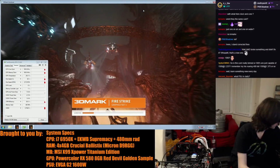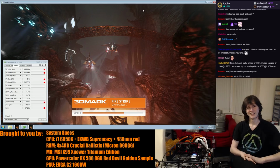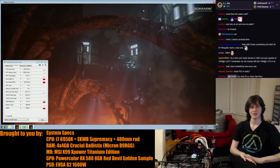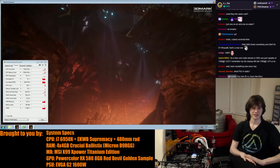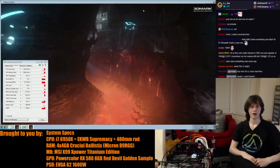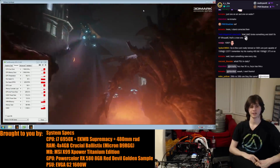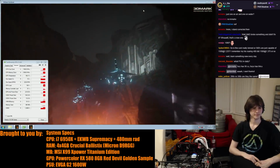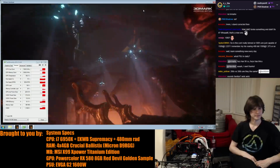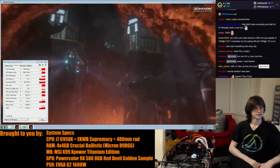The power supply in my daily system is an Antec High Current Gamer 850 watts. It's way too big. My daily system should probably be on a 550 or 650 watt power supply, and it's on an 850. So yeah, that's not good. Well, it's basically that I am wasting power for no good reason, because at idle, that power supply is just not going to be efficient. Hey, the fans are now spinning up before 60°C. That's interesting.